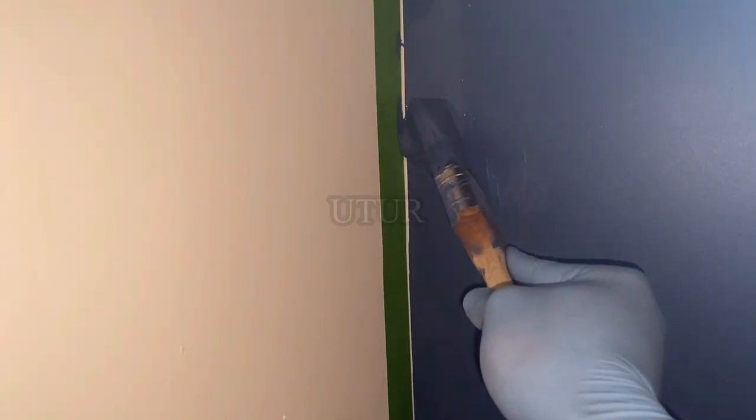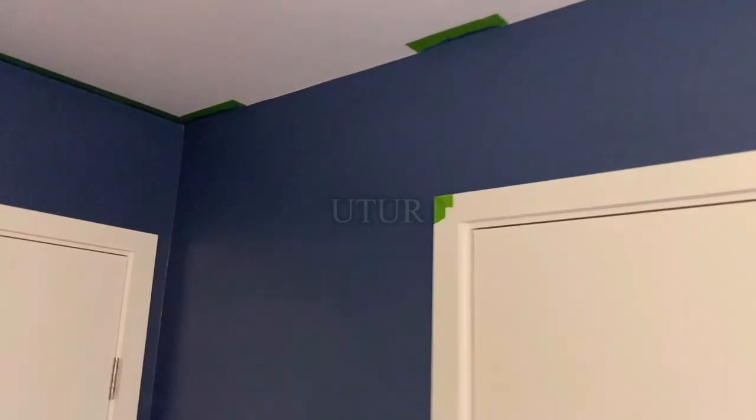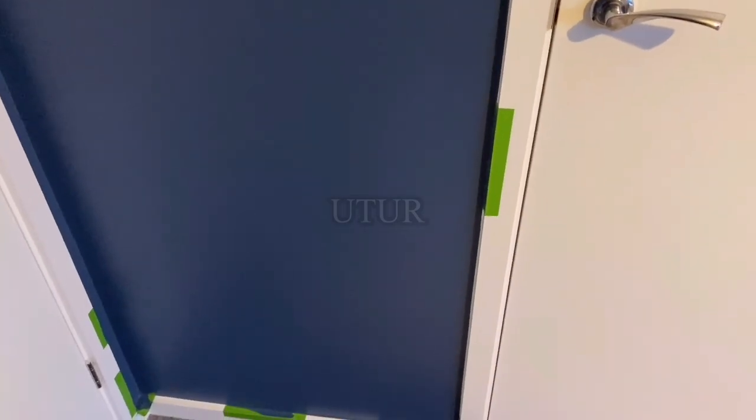You can see I've got segments of tape on the ceiling, around the doors, in the corners. There is a gap there, so I've run tape over the straight line again and will be painting over the gaps. With contrasting wall paints you always need to check for pristine lines — where you've got gaps, place your frog tape over there and redress and paint. Keep checking, keep redressing, keep re-masking and keep painting over till your lines are perfect. Once you've sorted your straight lines, you can take off the tape. Click the link in the description for how to prep, mask, paint and take off your painter's tape.